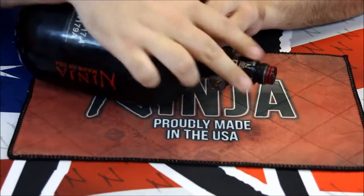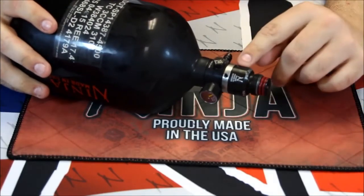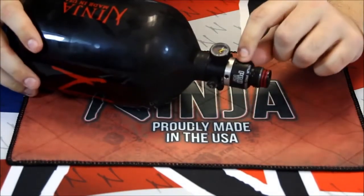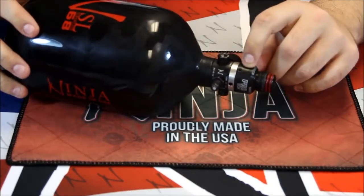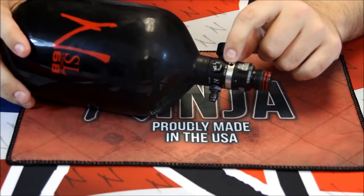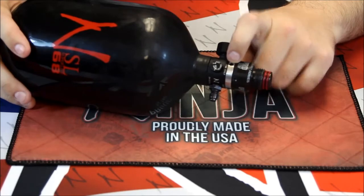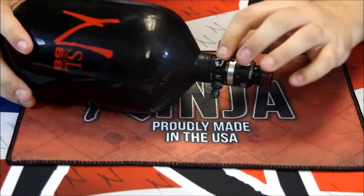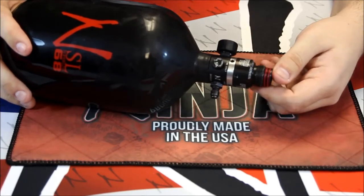Once all that's out, it's going to allow us to remove this a bit better. We are going to remove these 3 bonnet set screws. There's 3 of them here on the bonnet. You do want to make sure that you are not removing these set screws in the rotational collar on the Pro V2 reg. Those will stay in there. Those set screws are only to be loosened up to rotate the system, which of course you want to do when the system is empty. But for the sake of this, we are going to be removing those.